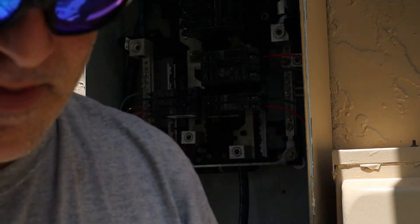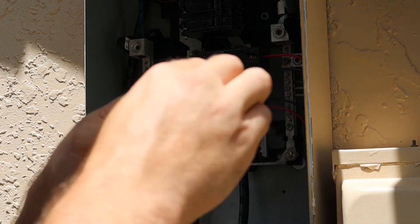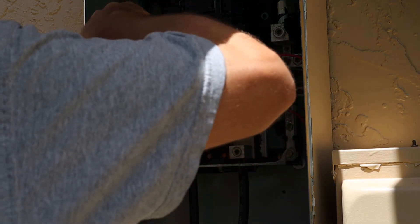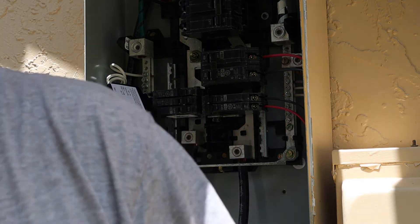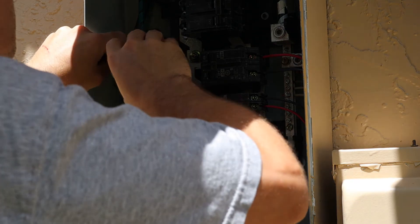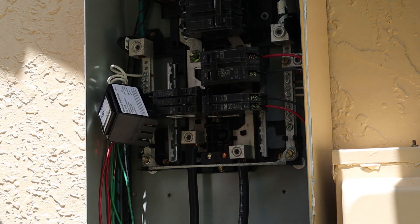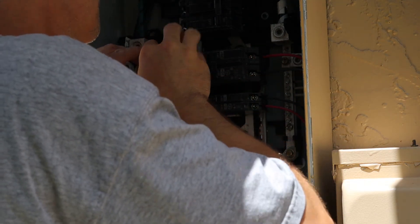Here's the old one. Let's take the new one and put it in. You want to keep this neutral wire hooked up as close as possible to the surge suppression device. I'm going to feed that back in there under the same screw and tighten it down. If you're not comfortable working around electricity, I strongly recommend turning the power off first, just for your own peace of mind.